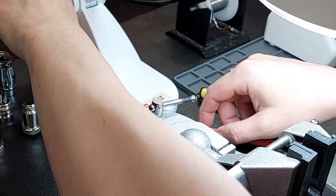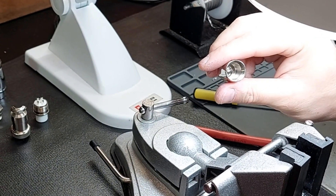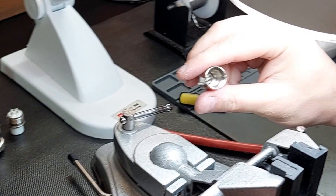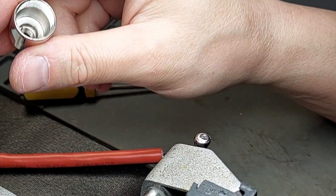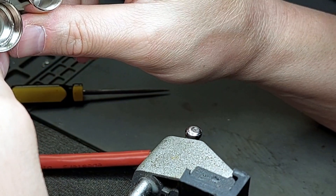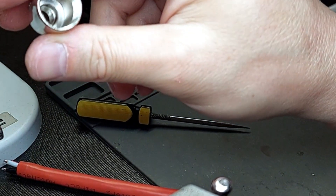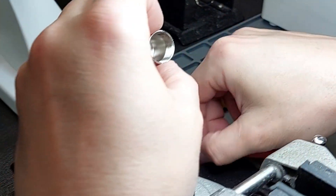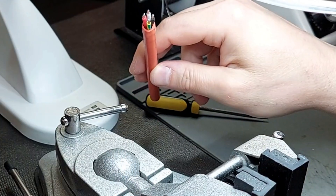Then of course the H17 — this housing naturally has to be machined out. That's why the labor goes up to what it does, because until it's machined out, just like the black connector, it's useless. You can see how these are small — you can see the bore diameter in there. Nothing will fit, meaning a standard 16-gauge will not fit through that hole. So it must be opened up.